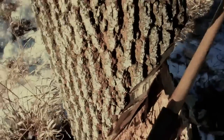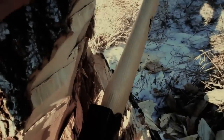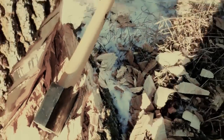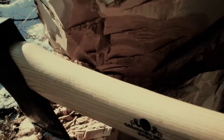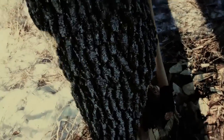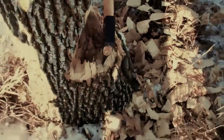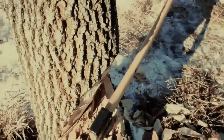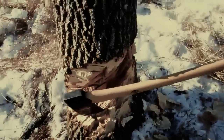Now you can see it's just one big 45 degree cut into the base of the stump. The stump looks real kind of ugly, but that's okay. I'm between a third and a half of the way through the diameter of the trunk. At the request of the landowner, I decided to make the notch more on this side of the tree, trying to cheat as much as we can away from it falling into that other tree. I don't know if it'll work, but at least we tried.